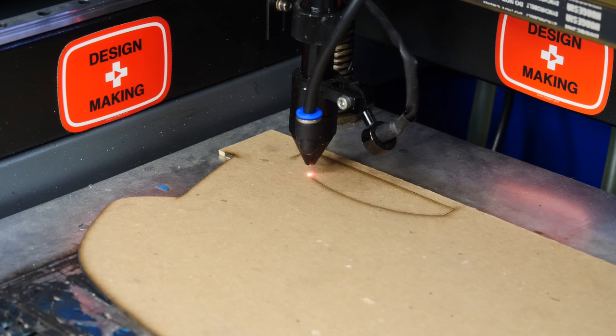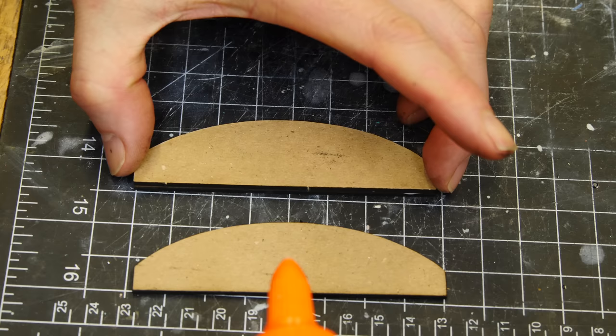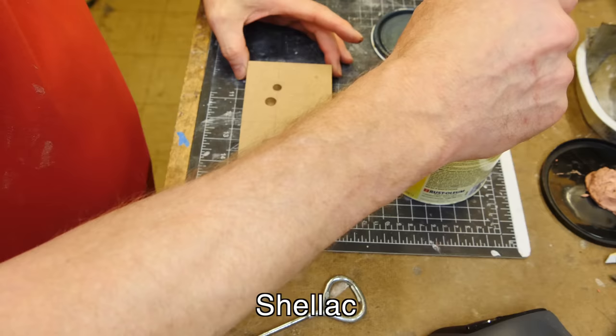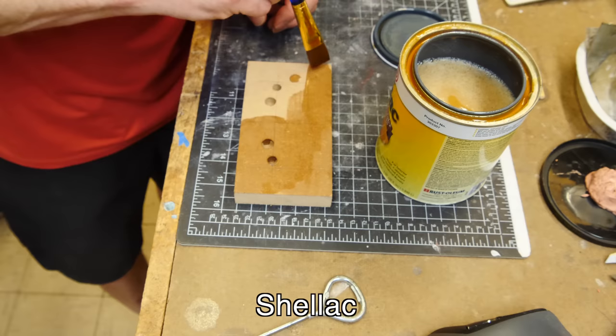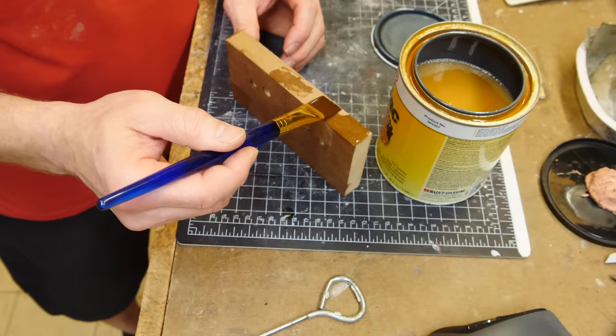This is a little confusing but stick with me — it'll all make sense when we cast the second part of the silicone mold. I'm going to use a little bit of white glue — yes, the same stuff you used in grade school — to glue the cardboard together. It's cheap, effective, and readily available. I'm going to bust out the shellac. This is my favorite sealer — it's not water soluble and works great on wood and fiber products like cardboard because it creates a nice seal for the silicone to set up against.